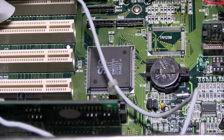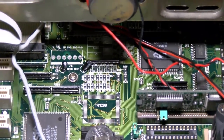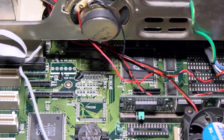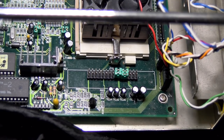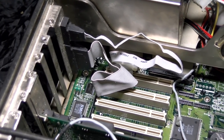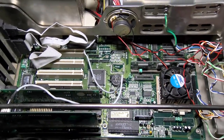The board has the SiS 5510 chipset, which is quite early in the realm of Socket 5 systems — which this is, for all intents and purposes, despite saying Socket 7, because you need a VRM to install a real Socket 7 chip. This board at least does offer the option. Strangely, this one has jumpers, whereas my original one had a little passive VRM card, which is about the best you could hope to find. I know that TMC provided that card, so I guess they were making cost-cutting measures by the time they got around to this board. The SiS chipsets on here date back to the Socket 4 days, so I do imagine that's going to have some kind of impact on performance.